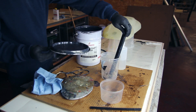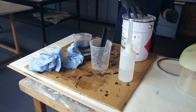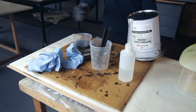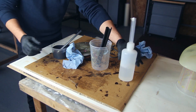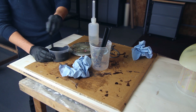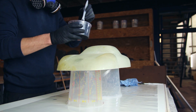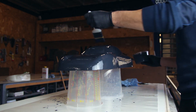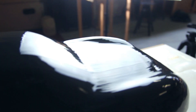Also very important: this had a 1K primer and 1K paint on top from a rattle can, and these types of spray paints can cause problems with polyester and epoxy resins. So we're going to use pattern primer to create a nice seal on top. The pattern primer is an easy-sandable polyester resin you can put on top of parts — Easy Composites sells the coupling, the pattern coat, and a gloss coat as well. Mix the can well and add some MEKP hardener — normally around 1–2% depending on your environment, as temperature has a big influence on cure speed. For the first coat I apply it with a brush because I want a thick coat I can sand flat.